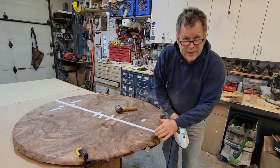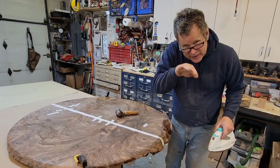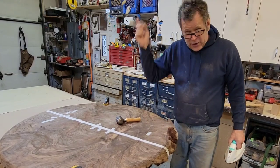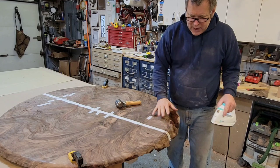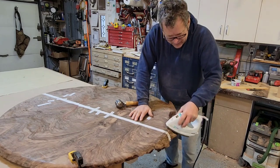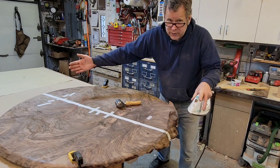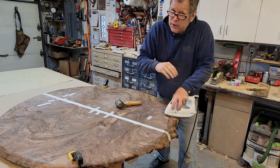Once you get a better idea of how long that veneer needs to be, we'll cut that off and then we'll iron on the vertical surface in that last little radius. I've wet this a little bit because you're essentially steam bending. In this piece of walnut burl I could have used my flattening conditioner, but it is a little dry and this is a gradual radius, so just with the use of water we'll soften the fibers with an iron. It will literally steam the fibers and soften the lignin — the resin that holds the fibers together — and I can compress this down. Essentially what you're doing is taking a larger circumference, and when you roll it over it becomes a smaller circumference. So the fibers don't have to stretch, they have to compress.